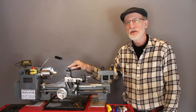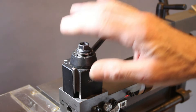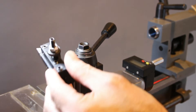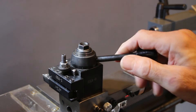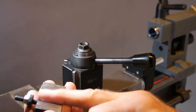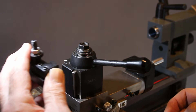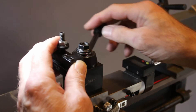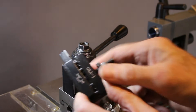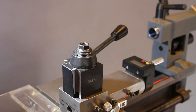Quick change post — let's jump in there. This is one of the first best improvements you can do to your mini lathe: put a quick change post on here. The way it works is you have replaceable inserts that you can drop onto it and lock it in. This dovetail closes down — it comes down and grips laterally and grabs this way. There are others where a button pushes out this way to hold it, which can push this out a little bit — I don't like that. I prefer this design. They're relatively affordable. I bought a whole bunch of these tool holders, and you can put in different tools as you choose.